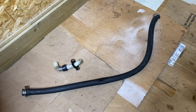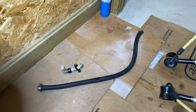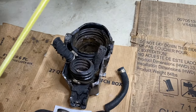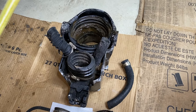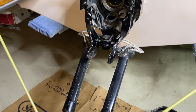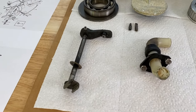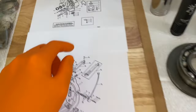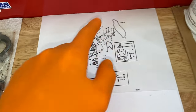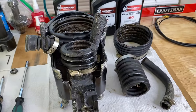Outside the boat — here's everything we just removed: that long hose with clamps re-secured so we don't lose them. We'll take everything inside, clean up the old water tube, install a new bushing, and prepare it for reinstallation. Transitioning inside to the workbench — taking the entire bell housing and all removed parts inside. At the workbench we've got our shift crank, the water tube, the bushing, the cover, and the bolt. Still to remove: shift bellow, exhaust bellow, water tube hose, and U-joint bellow from the bell housing itself.